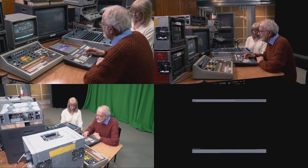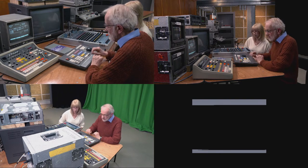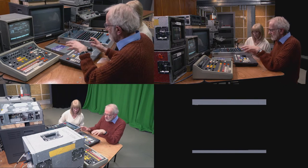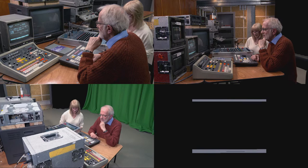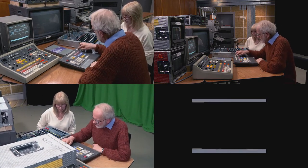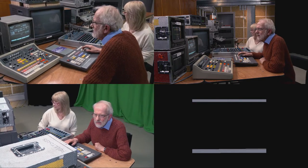Okay, what I'm just doing is setting up the recorder at 10 hours because we like to stripe our tapes starting from about 9 hours 59. So we've got about a minute or two slack on the front, but we actually come in at 10 hours. So I've marked that recorder in. Lovely. Right, now hopefully I'll set on the player.